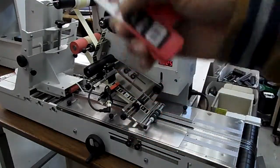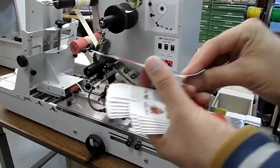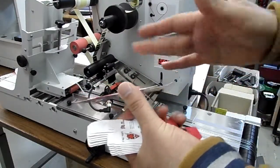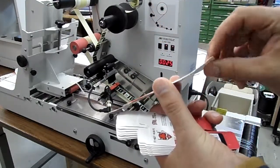The only thing we have to do is a minor modification of the input hopper, to make sure that the box, when it's transported, this flap here sometimes is not really even. We're going to put an additional roll on the top which actually presses down this flap.